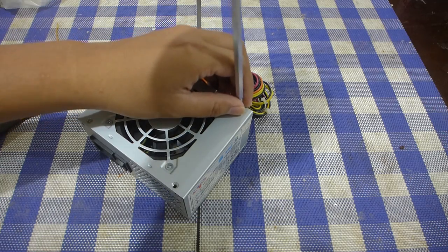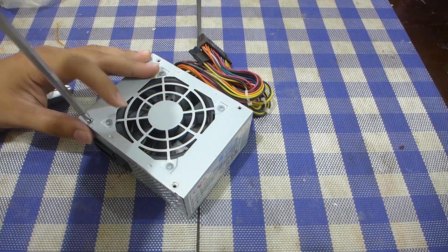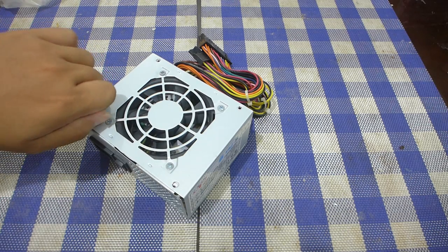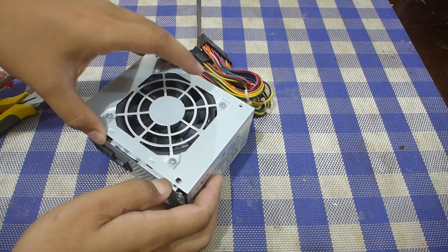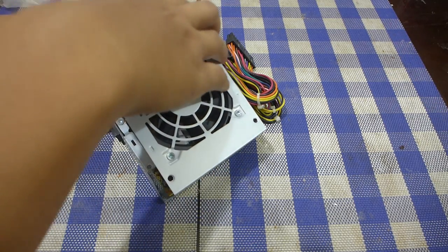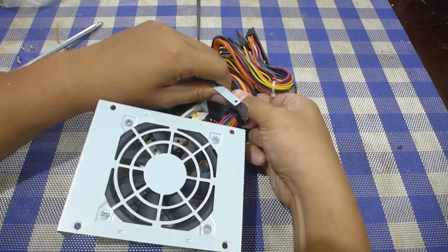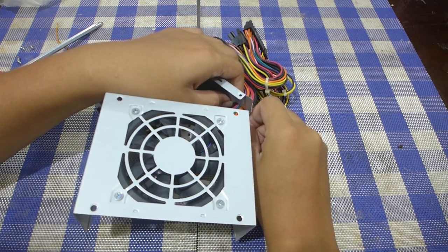So hopefully sticking an ATX power supply on this Desknoob is pretty much straightforward, because, if I haven't mentioned it in the last clip, the Desknoob doesn't need negative 5 volts from the power supply. It actually generates its own with a 7905 present on the motherboard. And most AT power supplies also use a 7905 internally to get negative 5 volts. So I've thought about possibly cobbling together an ATX to AT adapter board that has the 7905 present on it, so you don't have to use that stupid voltage blaster thingy. I'm surprised no wanker engineer has done that yet.